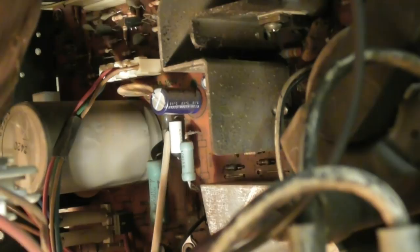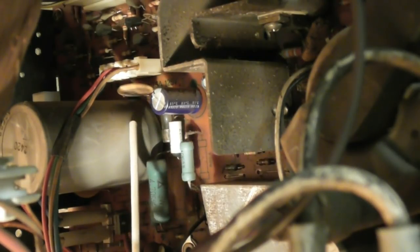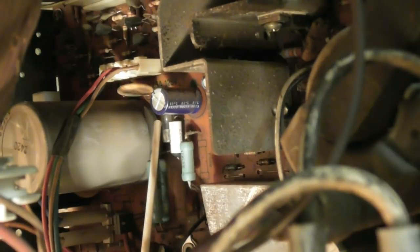There will be a lot of voltage in this — ask me how I know. A couple of nights ago I got in here with my probes to check that fuse and I got continuity, which told me the fuse was not blown. But it was making a circular path somehow through the circuitry — that fuse was in essence blown. I probed it, came back in, couldn't quite see if it was blown, so I stuck my finger in to wipe the dust off and it just gave me a jolt. I grounded between my finger and my elbow somewhere. Buyer beware — be very careful.